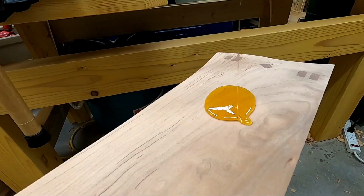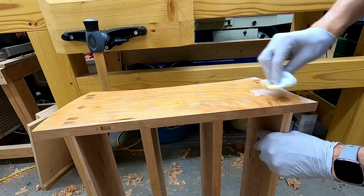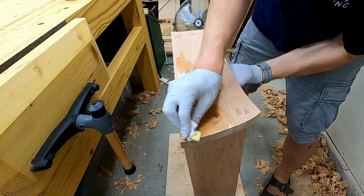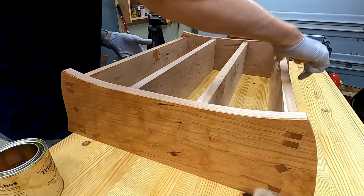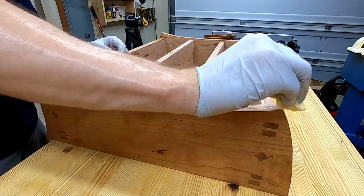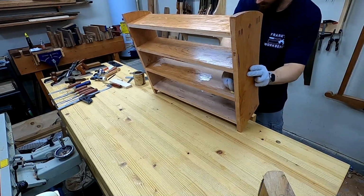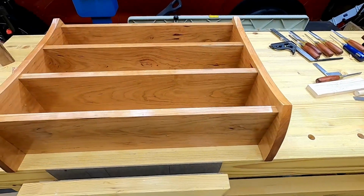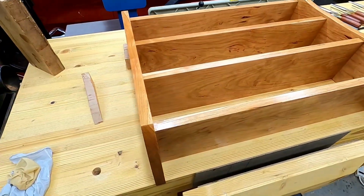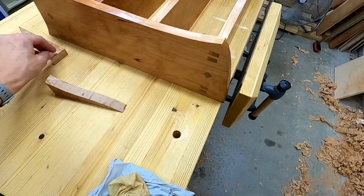Went with tried and true varnish oil here. A couple things about this finish. One is that after about an hour of it being on there, you have to really thoroughly wipe off everything for it to cure well. The other thing is that it's mostly about the surface prep. The wood needs to be almost burnished, especially on the end grain. You can do it with either some plane shavings or with like 320 grit sandpaper. And probably the only benefit of a super hot garage is that it helps the finish cure much faster.